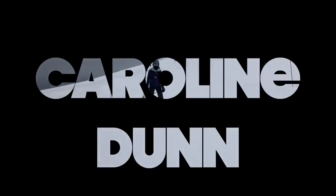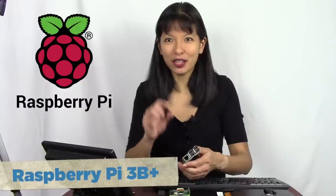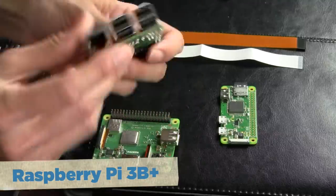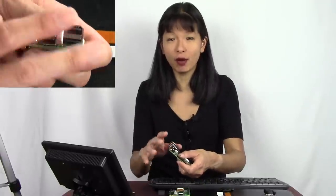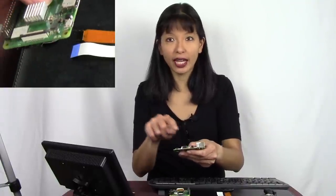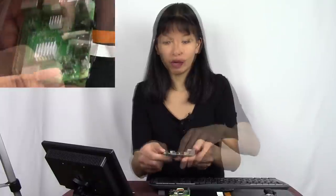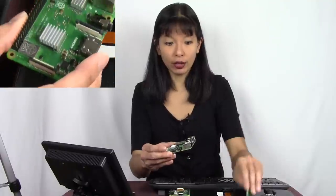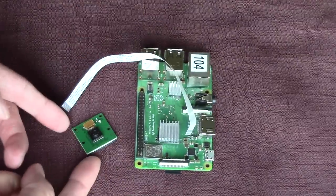Let's start by talking about the different kinds of Raspberry Pis available today — specifically what I personally own. Number one is the Raspberry Pi 3B or 3B Plus. This is the flagship device. It has four USB ports, an Ethernet port, wireless internet capabilities, a full-size HDMI port, a sound output jack, a micro USB power connection, and a slot to connect the Raspberry Pi camera via ribbon cable.